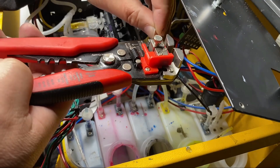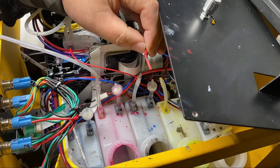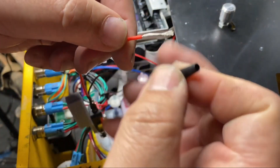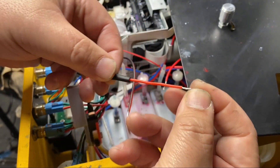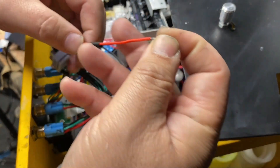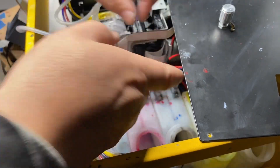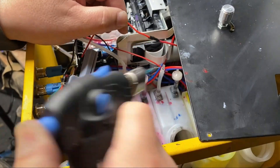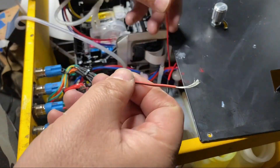The wire stripper. If you don't have a stripper at home, I can show you how to do it with a cigarette lighter. We're going to slide the shrink tubes onto one of the wires. Those two shrink tubes are included in your package. We connect the two wires, slide the tube on it, and apply some heat — you can use a hair dryer or something. It doesn't matter whether you connect black first or red first.